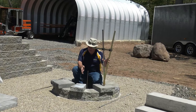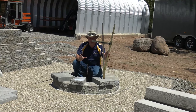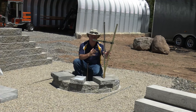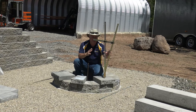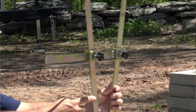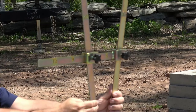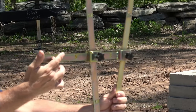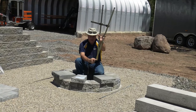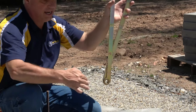When it comes to marking these exact pie pieces on a fire pit cap or any type of radius, we've created the radius template. This is a phenomenal tool that makes it super easy — it helps you with your math and helps you get perfect cuts. We've created it with the radius measurements on the two sides, and also with the width of your cap up to 14 inches. It also has a hole that you can drop over your center pin to get your radius.